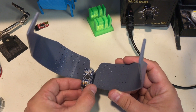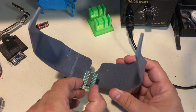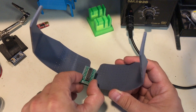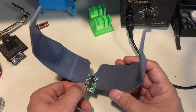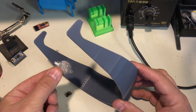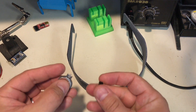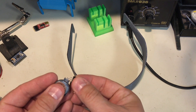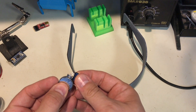I had to choose a microcontroller. I had this little Arduino mini but it was actually too big. So I decided to use my own little board with a PIC microcontroller, and I could cut the top of the board off so it'll fit right at the nose bridge. The connections are perfect for the wires, and I'll use a CR2032 3-volt battery and add a switch for an on/off on the side.